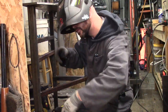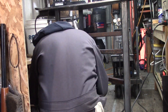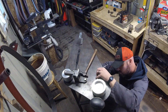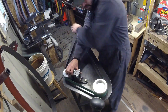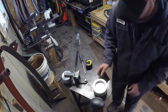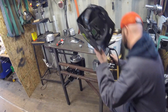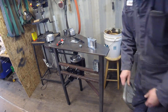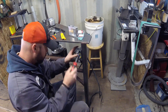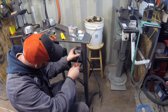After welding this up I did mount the gas shock and the little tab on the tensioning device, but somehow I can't find that footage - I had over 197 different video clips so I apologize for losing a few. You can see the gas shock is mounted there. Now I'm tack welding a little electrical junction box to one of the legs - that will be where I mount my switch. It's not necessarily the proper way to do it but I tack welded it on there, then wired up the motor and switch. I ran it on a heavy SO cable - a one horsepower 110-volt motor on a 110-volt outlet.